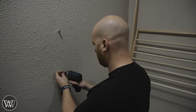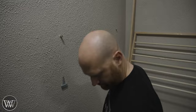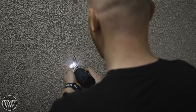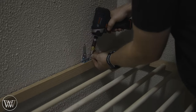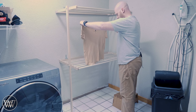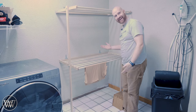For the actual attachment, I used magnets to find the screws in the wall, and I can attach a hinge so that the bottom of it is at 33 inches. Then I can bring over the shelf itself, put it in place, and the vertical with the bolt holds it up so I can run screws through into the back side. Repeat the same on the other side and then the top. And just like that, you've got a rack that sticks out from the wall, hangs, and actually looks kind of nice. The most important thing is that my wife likes it — and if she likes it, then I like it.